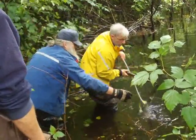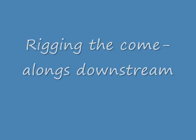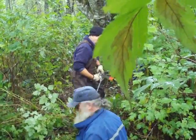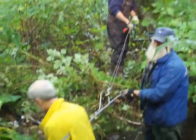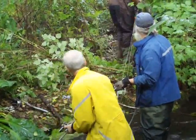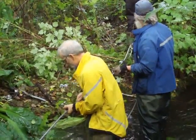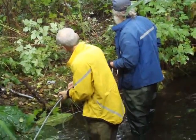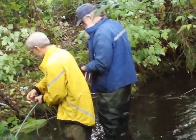We're going to need a tail hold on that tree — there's a chain. Now we're rigging the come-alongs to pull the cable back and hopefully dislodge the dam. Jim's rigging the sliding eye and we're going to run two come-alongs, pulling one up tight as far as it'll go and then switching to the other so we'll always have tension on the cable.